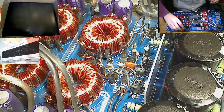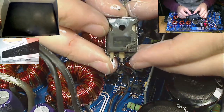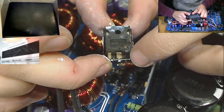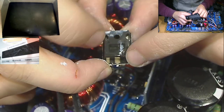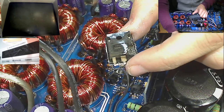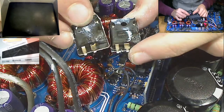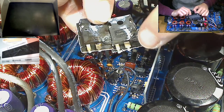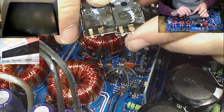One interesting thing you can sometimes tell with these amplifiers when they fail: if we look at the way the MOSFET failed, you can see the burning happened on the source leg. The source leg has ground and the drain leg has 12 volts from the battery. All of these MOSFETs failed the same way, so all of that current from the battery has been used up cooking this ground leg on all of these power supply MOSFETs. So hopefully